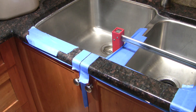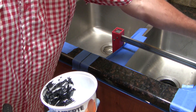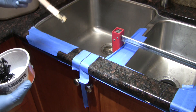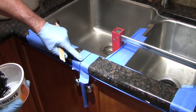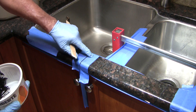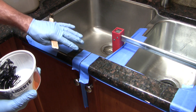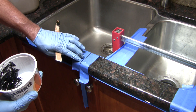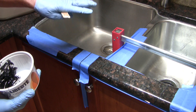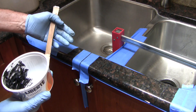That's one batch — it didn't take long to set. Now we'll do the other batch. I was advised to use painter's tape here to raise the level to compensate for the shrinkage that naturally happens as it dries. By raising the level we build it up, and then as it shrinks it comes down to the level of the stone, and then you razor-blade it off.